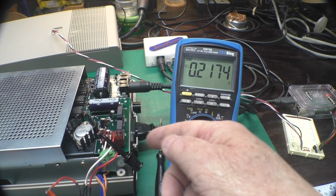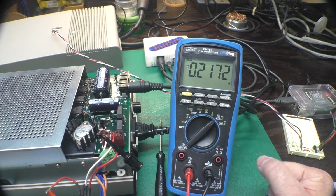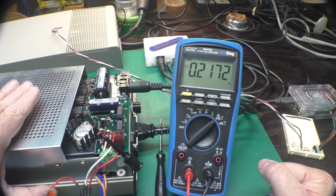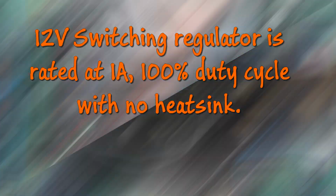And I've already measured the 10 volt AC side, our white wires here, and that is about 1.1 amps all the time. It doesn't matter if the drive is running or not. That provides the 5 volts to the circuit board. So now we have an idea of how much current this drive takes, and we'll have to see if our regulators can deal with that.